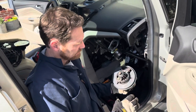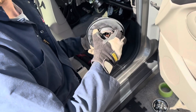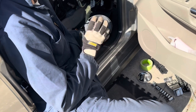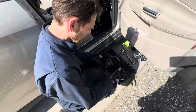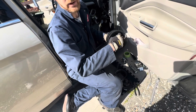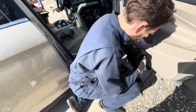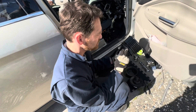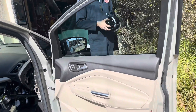We got the old motor out and it wasn't easy. If you look at the back there's these little ramps, so it's a twist-lock type design. We did have to bust the fan blade out of the way just to be able to grip it and turn it. Out with the old and in with the new — these do look the same. We're gonna pop this down deep into that hole and then you really can't twist it from the front because it spins, so we're gonna pop it through and I'll try and twist it from the back. I want it to slide easily so I might spray a little grease on here — sprayed a little white lithium grease on that to make those slidey-locky things twist more easily.